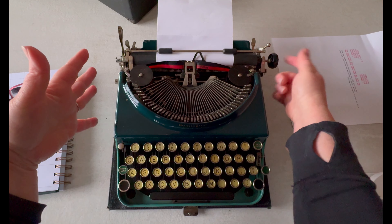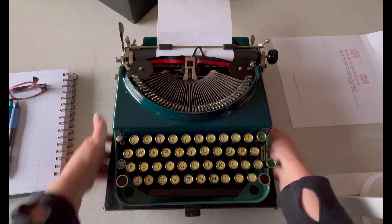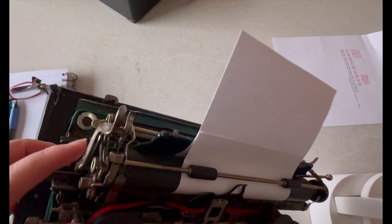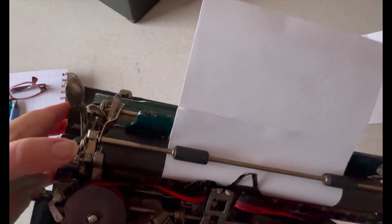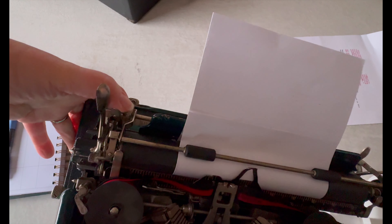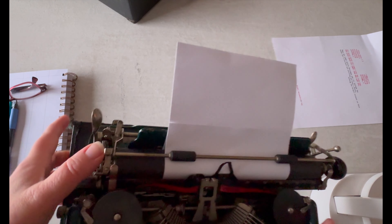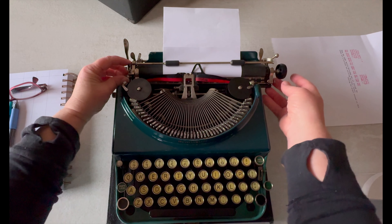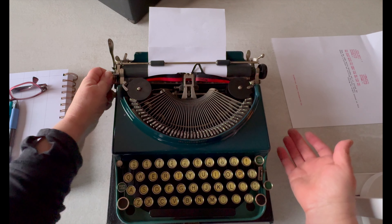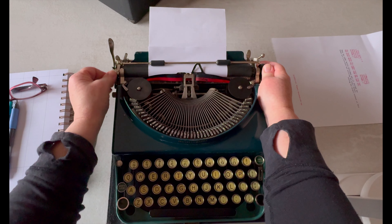As you're typing you'll kind of hear the paper crinkle. To put the cover back on you have to put the handle back in. To do that, there is a tiny lever right here — I'll hold it up to the camera. So there's your carriage release in the back, this is your return handle, and this little lever releases the roller handle. You push that in, then push the handle in, and release it.